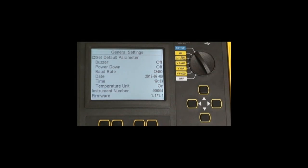In the setup mode, we can pre-define every possible condition for the instrument to operate in: the amount of time it will run the test, any temperature correction it's going to do, the date and time, the baud rate, and so forth. The whole series of programming features can be programmed into the unit.